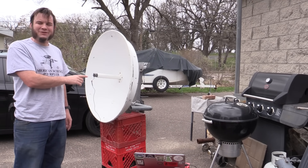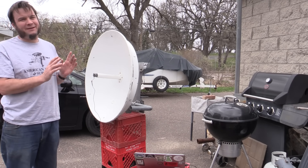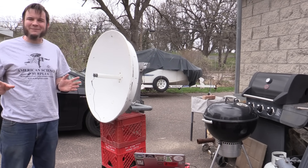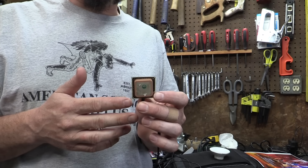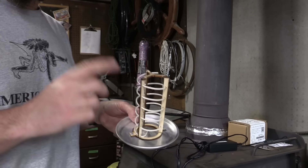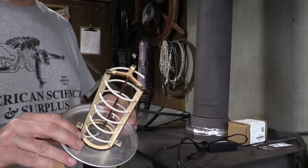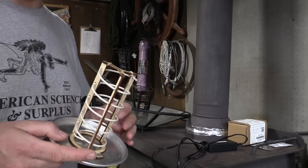But that's not working. I think I may have damaged my GPS antenna previously, because I'm not getting a jump in signal when I turn on the amplifier. When I turn on the bias-T on the software-defined radio, which gives voltage out to the antenna, nothing changes. I also realized I don't remember the polarity on these little patch antennas. There's also circular polarity, and these will pick up a linear horizontal or vertical signal — they'll do equally well with both, but they'll only give you about half the signal strength of a properly polarized antenna. I've used these with GOES before, but they're not ideal or very efficient for it.